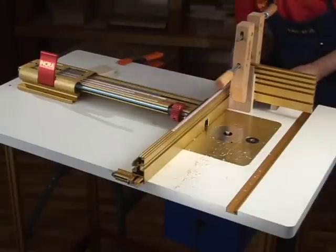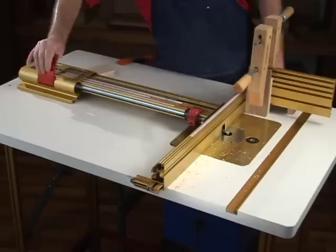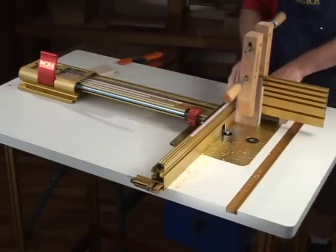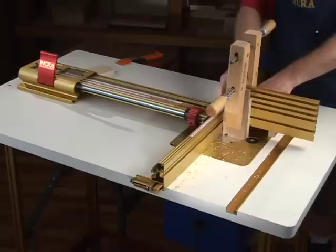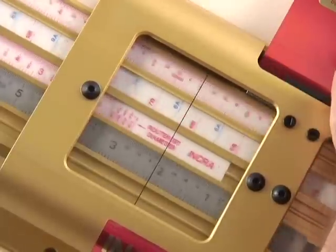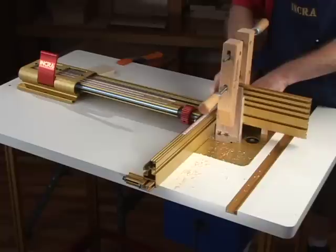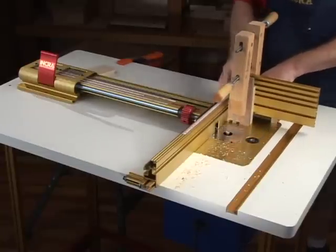Move the LS to the first B-cut location, which places the bit just outside the fence, 6B in this example, and make the cut. Now, move the fence from one B-cut to the next to complete the cuts across the full width of the pin boards.